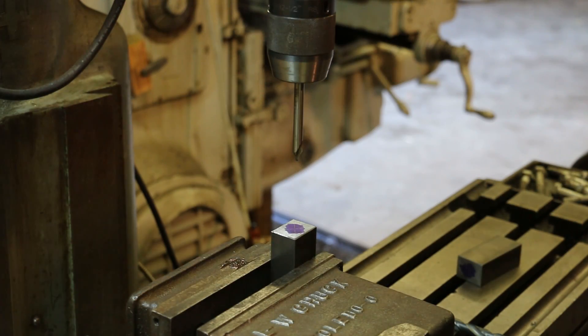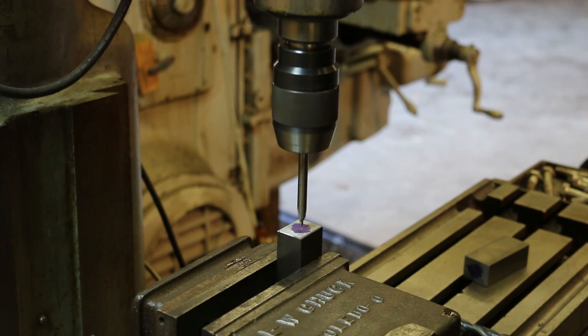Now with the arms cut, we're going to go ahead and drill and tap the holes in here that we will thread the bolt down. It's going to be half-inch 13. So we'll start with a center drill, drill that out, and then tap them.